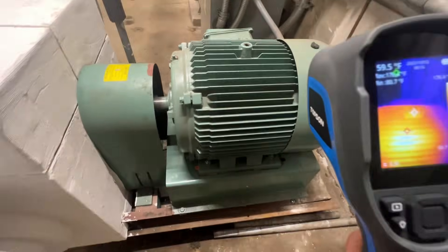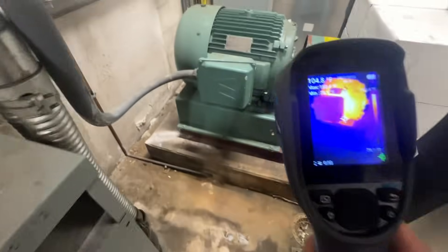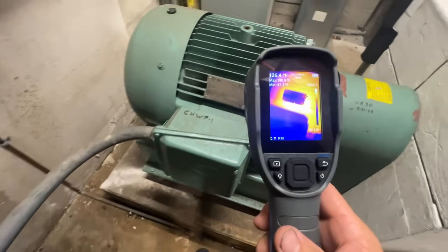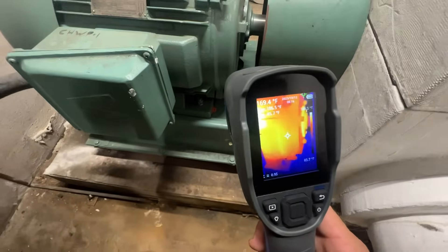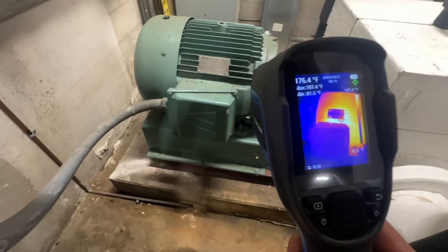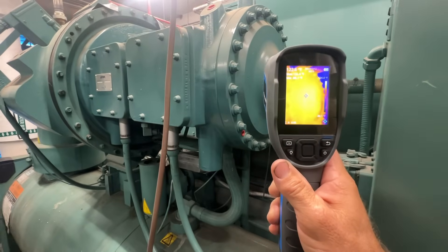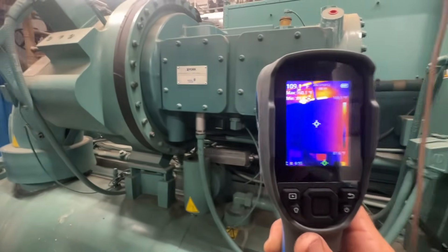Let's take a look on the other side here. About 84 degrees on that. But our motor is 190 degrees - you definitely don't want to touch that. Let's take a better look at that starter panel and carefully inspect that. Check out the difference in temperature here. This is the magnetic bearing, so our temperature on this motor for the chiller is 123 - compared to that other motor over there. These machines are definitely a lot quieter.